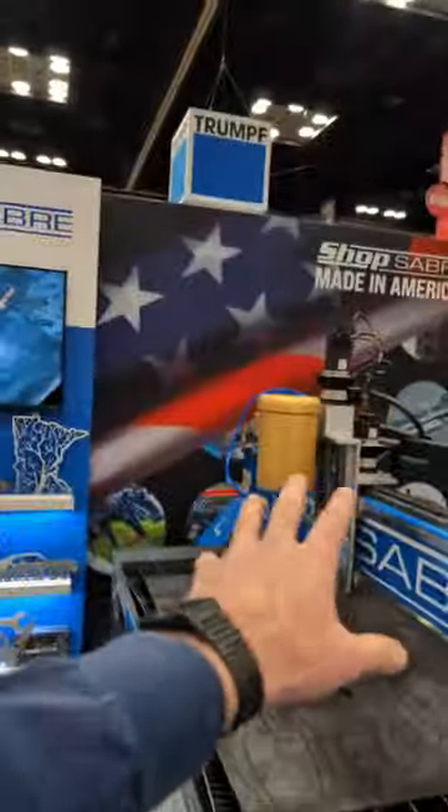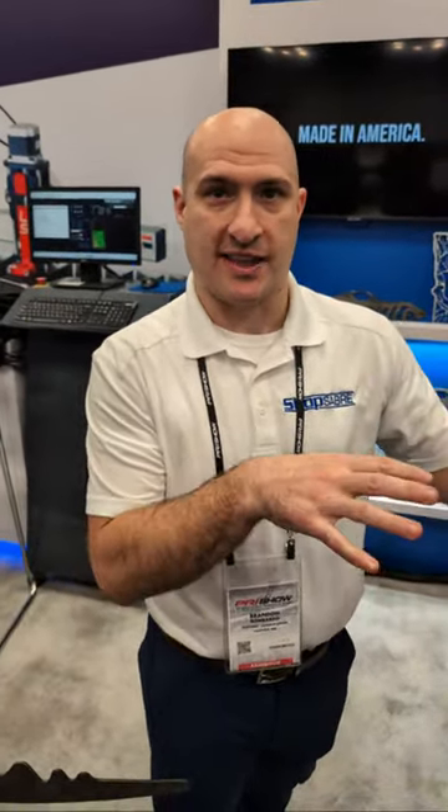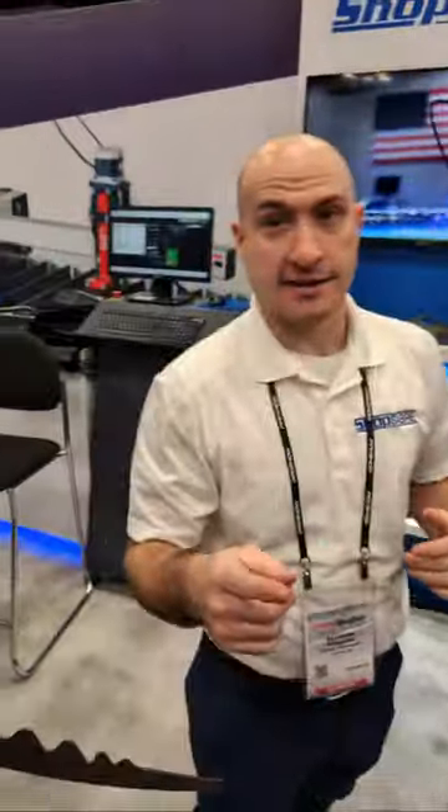So having that drill head right on there — and the way it's kitted out, this comes just like it is. So thought-wise, planning, designing the part — how does the workflow work with the drill and the plasma? It used to be you cut your parts, take it off, and then start drilling holes and burning out bits. Nowadays you design everything out. The holes are already in your CAD. Most of your designs already have the holes in them, and then you just ignored them when cutting. Now you don't ignore them. It'll go around, drill all the holes first, then come back and cut the parts out. So once the part is cut, it's ready for weld, ready for install, whatever you're doing next. You cut a sheet metal cover, cut it out, bolt it right on when you're done. You're testing it right away. You're not having to go drill it — did I put the hole in the right spot? This just solves that problem. And it's super in the right spot. If it's in the wrong spot, it's in the wrong spot because you told it.